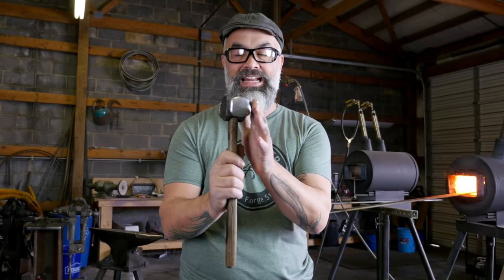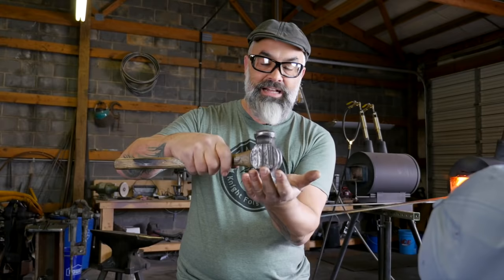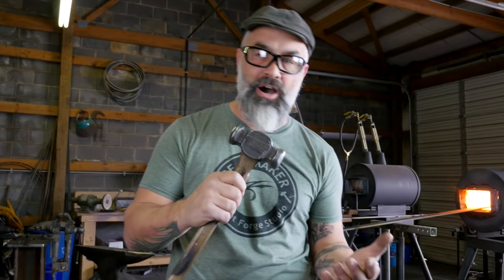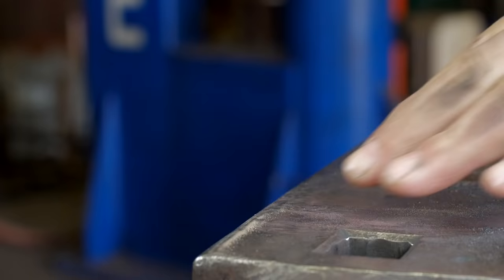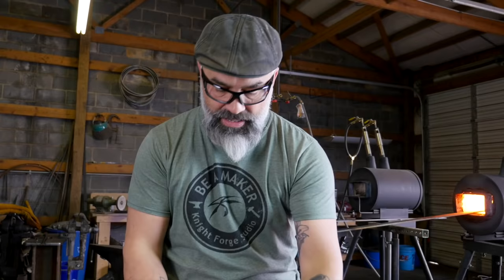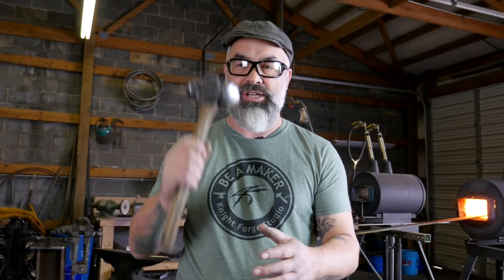I'm using a rounding hammer — one side's rounded off, the other face is flat with some radius and fullers on each side all the way around. I can go flat to smooth the blade out, or use the edges to define something. This is for moving, this is for smoothing. I'll be using something called a half-on, half-off face blow — that means when I'm moving this steel very rapidly, I'll use the rounding side with half the face of the hammer on half the face of the anvil. I'm hitting directly into it, but I may turn the hammer angle a little bit because I want to move the steel — basically pinching it between the anvil and the hammer.